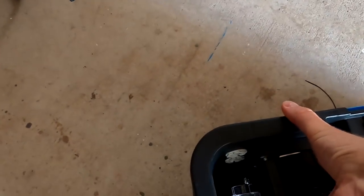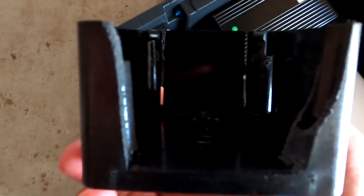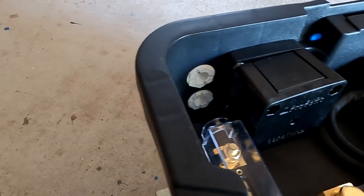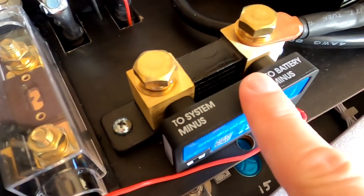We couldn't do anything until Monday anyway, and we've got the whole weekend to do something with the battery. We also have to look at the inverter in the next video — all of this is coming this weekend. I will monitor everything once we get the inverter set up and running with load on it; I need to measure temperatures and voltage drops. Here's a modification I did — you can see this cable here, this is exactly our voltage sense for the shunt.